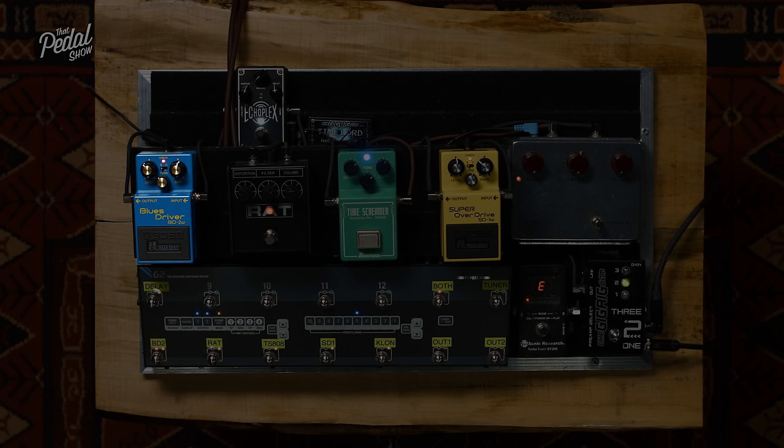Now what I'm going to do, I'm going to shift that EQ before the gain. So what's going to happen is, as I roll up the bottom end, those frequencies will actually go into clipping before the top end frequencies. As I change that and put top end in and the bottom frequencies, the top end frequencies will clip before the bottom end frequencies.